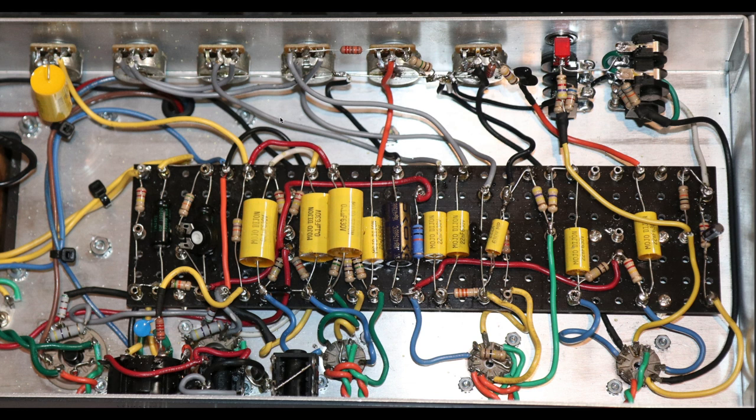Back to the tone stack. So your signal will come out of the treble wiper, right? This middle lug of the treble pot. Now this is a 220K, it's a 221K resistor actually, but you can just put a 220K resistor in here, good old regular carbon film, if you have it, from the treble wiper across to the input. This is the master volume pot, all right? I will be installing an effects loop in this amp.